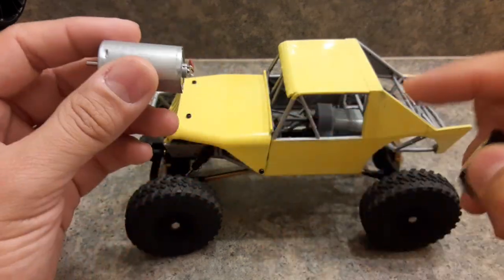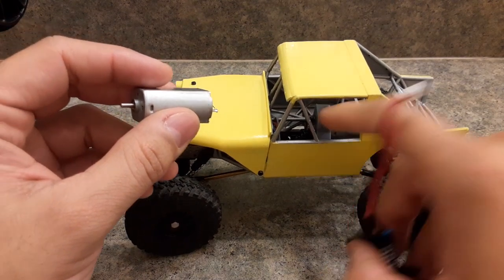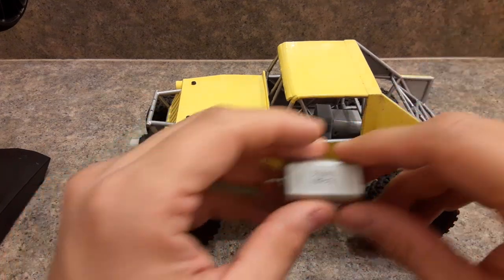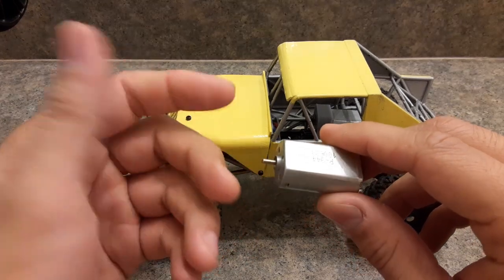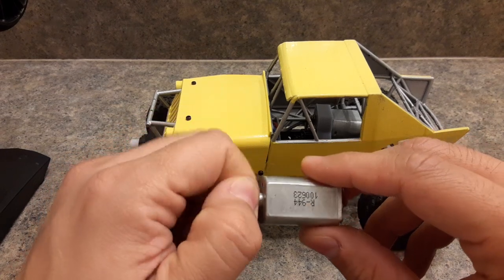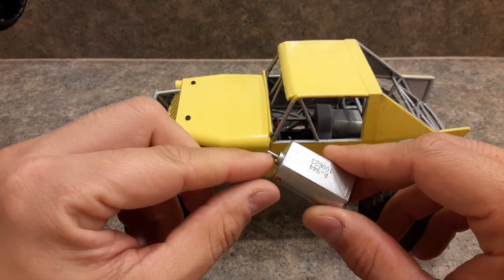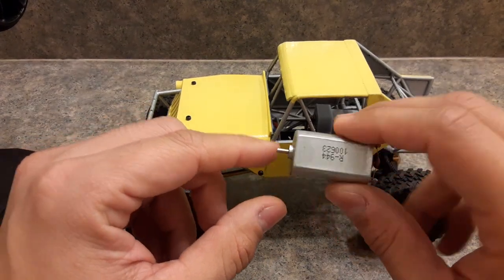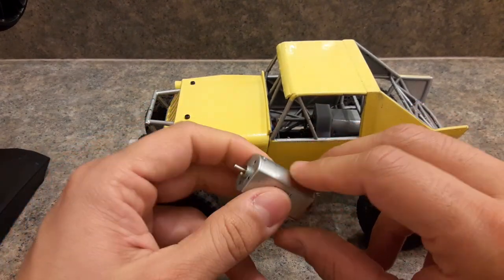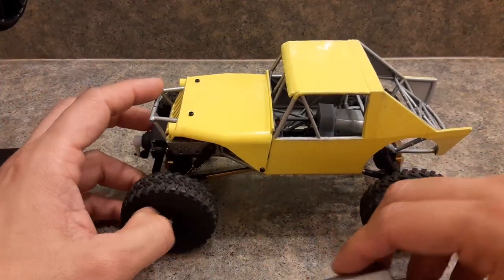That's the 'fat girl' motor mount that I have on my website on Shapeways — that's what you'd use to mount the 180. For pinions, you can get them on AliExpress or Amazon — the 10-tooth and also the 14-tooth. With this plate you can go up to 20 tooth if I remember correctly, so you can get a lot of speed out of it if you really wanted to.